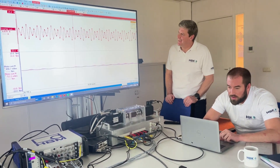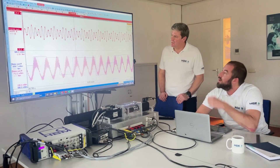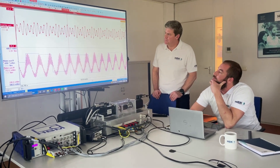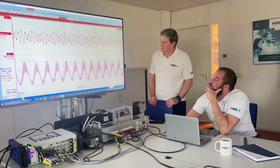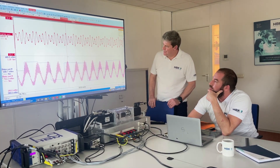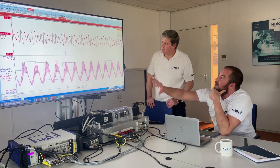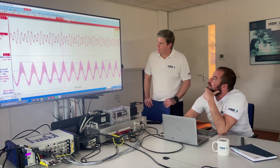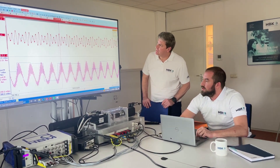Here's some data — we'll auto-scale it. Can you see that torque ripple? We have the average torque in blue, and we can see that it's bouncing around about 10 milli-newton meters. This is more dramatic than the torque ripple — that's slotting effects. That's magnets interacting with the slots. But you can directly line that up with the current, which is really freaking sweet.